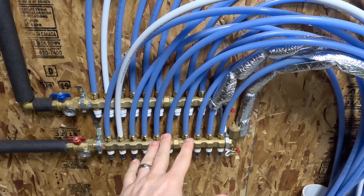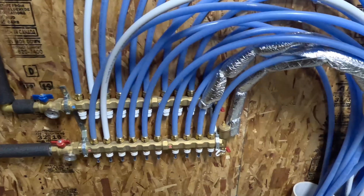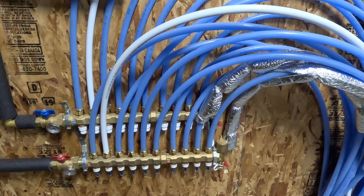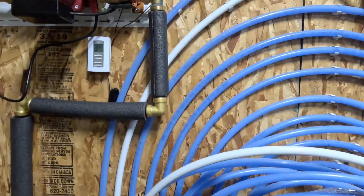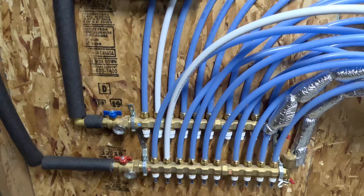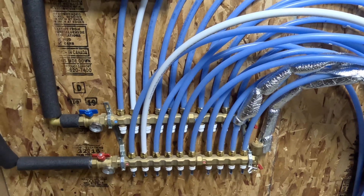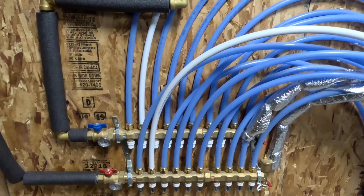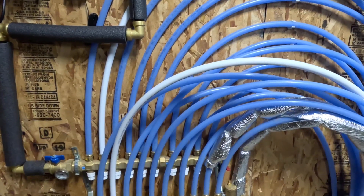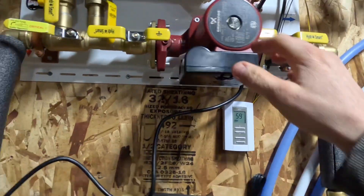We're flowing through a lot of lines — there's probably 40 gallons minimum in all these runs. They're on average 250 to 275 feet in distance and there are 10 of them, so that's over 2,000 feet of three-quarter inch PEX. I'm also doing a test on how well the wood boiler handles the system compared to before, since the flow rate is different. I also added another tank so I now have two tanks instead of one.